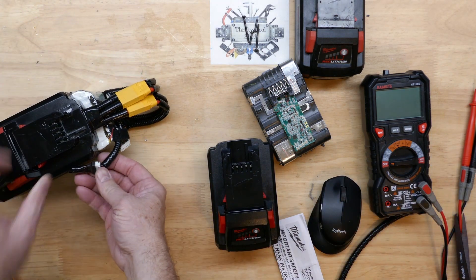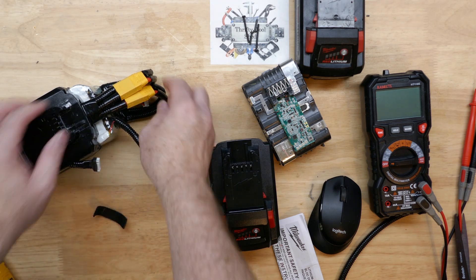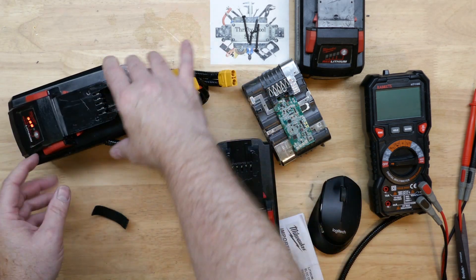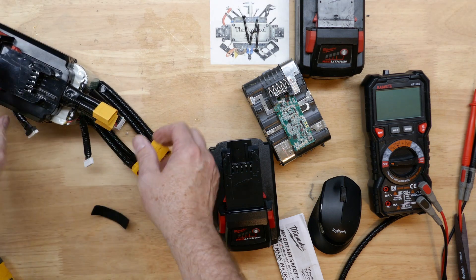This is how easy this is to disassemble and change out a battery pack. I've got one JST connector on this one and two of the XT90s. Of course, I make sure these batteries are extremely close in voltage before connecting them up in parallel because obviously a lot of current can flow.